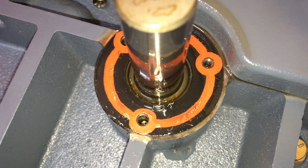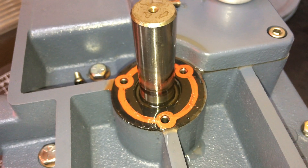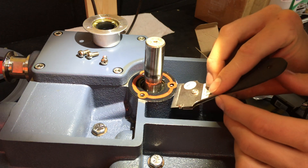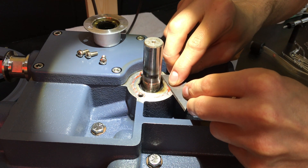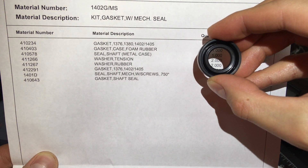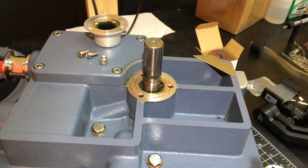I read that one drawback of the mechanical seal is that when they fail, the loose mechanism parts can actually cause damage to the shaft. My shaft looked okay — there were some areas with polishing, but I didn't see any severe grooves or damage. The shaft seal gasket had firmly adhered itself to the body of the pump, and a razor blade was required for careful removal and cleanup. Information about this other seal was scarce, and it appeared to possibly be the inner shaft seal. However, to replace it I would have had to crack open the case, and that was precisely what I was trying to avoid. Hopefully, just replacing this outer mechanical seal will resolve the leaking issue.